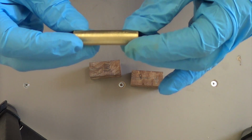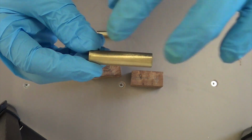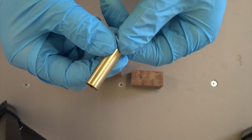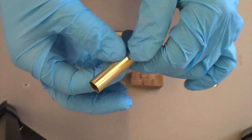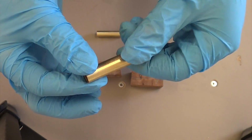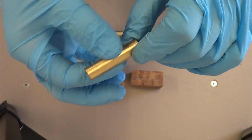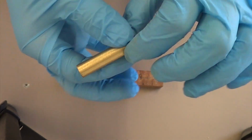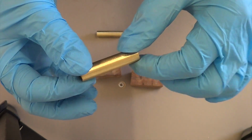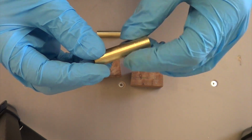So the barrels that you get from Penkits Direct come already with a keyed surface, so you want to check your brass tubes to make sure that it has had some kind of abrasive gone over it, just to make sure that the glue has something to adhere to. If you have a smooth brass barrel, then just take some sandpaper and go over the outside of it just to rough the edge up, and that gives something to allow the glue to adhere to it.